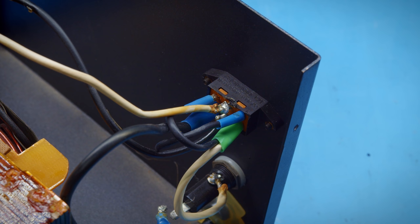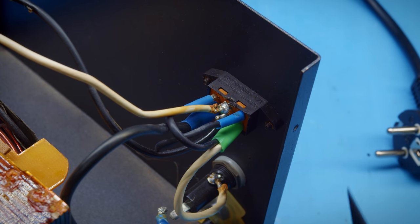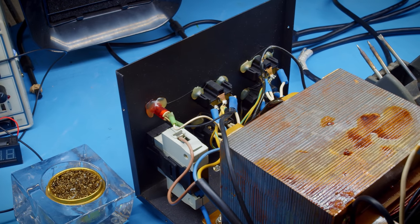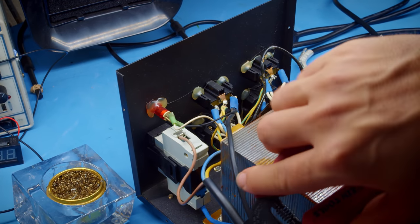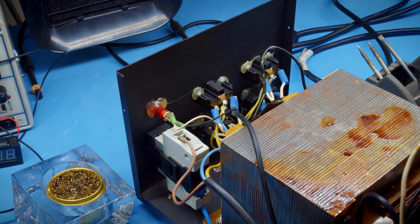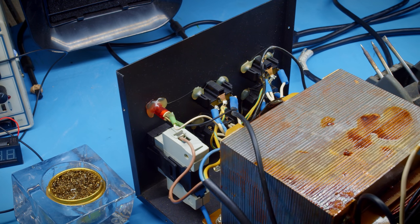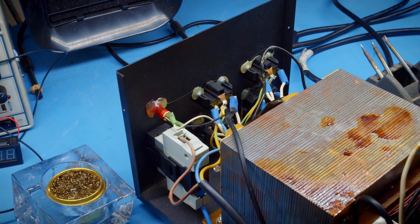Now I just need to go through and replace that cable so I can actually use this in North America. I feel a lot more confident now that I understand how it works, and I shouldn't have any problems replacing that cable so long as I make sure all the wiring matches. Things did not go well from here and I need to cover this differently than I thought. At this point I thought I was just going to mention double-checking the polarity of the new mains cable as I soldered it, but literally the first thing I looked at had a problem with how it was assembled, and that just continued from there. In the end, over half of the soldered connections in this thing were absolute garbage, and if I hadn't opened it and looked so closely, there could have been a real risk of fire.